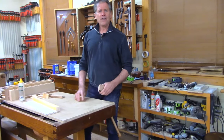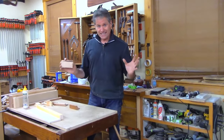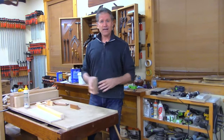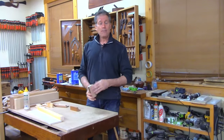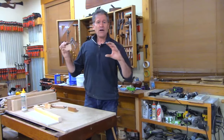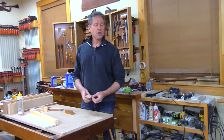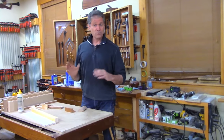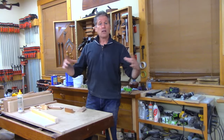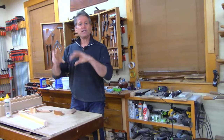A client in the design world had this idea for shelves made of granite — floating shelves available at high-end bathroom stores. We had to design a way for them to hang and be structurally sound to support granite. A square foot of three-quarter-inch thick granite weighs about 13 pounds; at an inch and a quarter, you're up to 18 to 20 pounds. These shelves were only about five inches wide, so they needed thickness for rigidity and wall support.